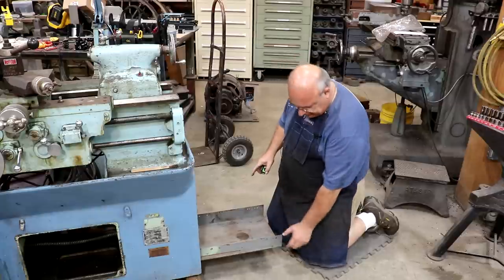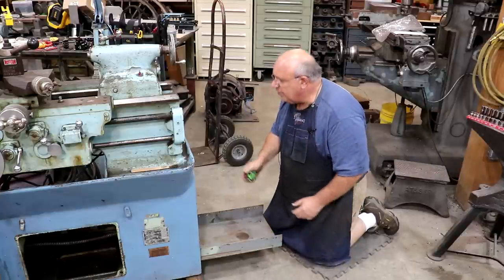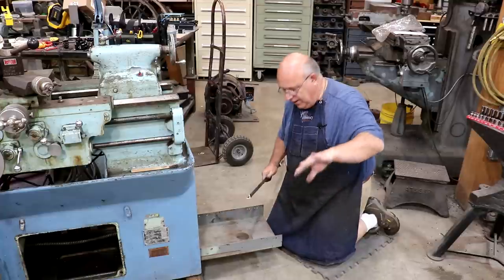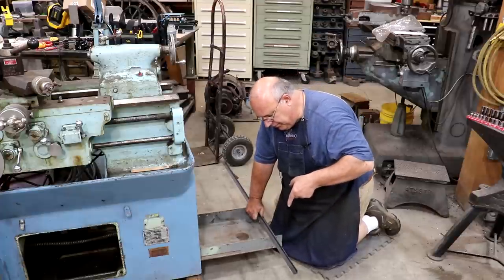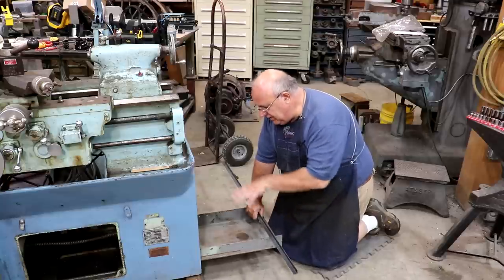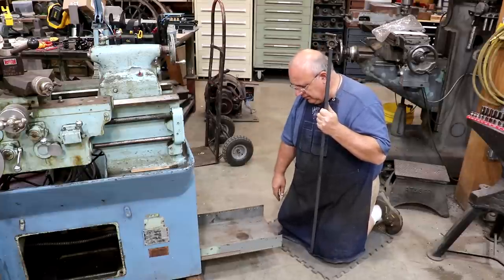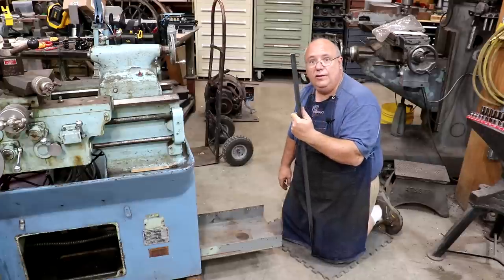Here's the game plan. This tray is just some fairly thick steel. You've got 12 inches from one side to the other, and there's a bend down in the corner. I've got this angle iron and I'm going to make two feet that fit down in the bottom — I'll cut it about an eighth of an inch shorter just to give clearance in that little radius at the bottom. I'm going to make two feet, one on each side, and from those I'm going to weld a 90-degree piece coming up. We'll just bolt the aluminum bracket to that — basically two T's in here holding up the panel, and we can screw the panel to that. These will eventually be screwed down to the plate so they're not floating around loose inside the machine.